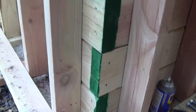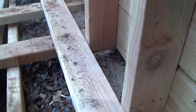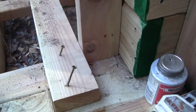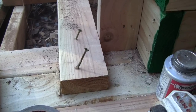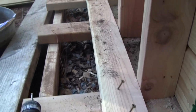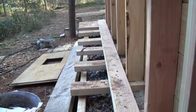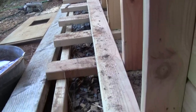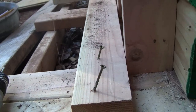The important thing I wanted to show is that I didn't put a bottom plate on the studs. Instead, I used a kicker plate, because the kicker plate ties directly into all the tension members that run across from one side to the other, giving you equal and opposite forces.